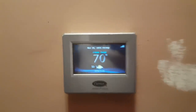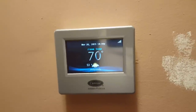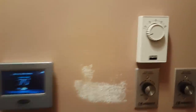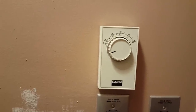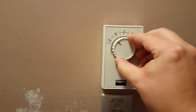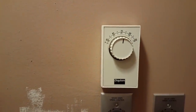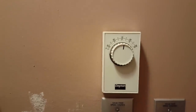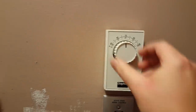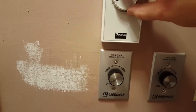There's the house thermostat. It is 53 degrees out — November 26th, Thanksgiving. Just got home from my parents, Harley and I. We're just going to test this thing out. There's a set screw in there to precisely adjust this. It's 70 in here now. That would turn it on at about 68 — there's about a plus or minus two degree swing — and then it would shut off at 71 or 72. So I'm going to turn the main control on and then we'll turn this on and watch it operate.